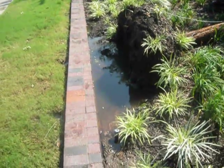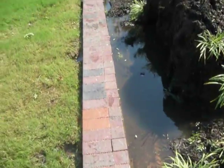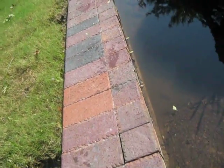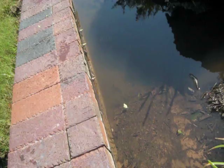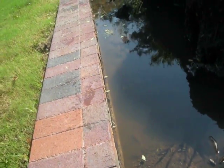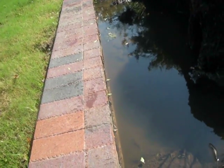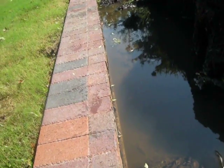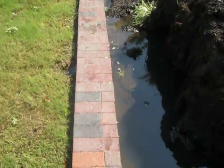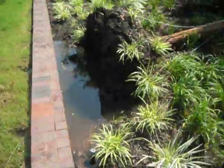As you can see, there's standing water here. This tree — this looks just like a brick edge, but as deep as can be found is a concrete base. The landscapers I just met with — the foreman and the manager — we went up and down here with probes trying to find weep holes in this concrete. Even without the weep holes, there's no penetration beyond this concrete. Clearly, this is saturated.